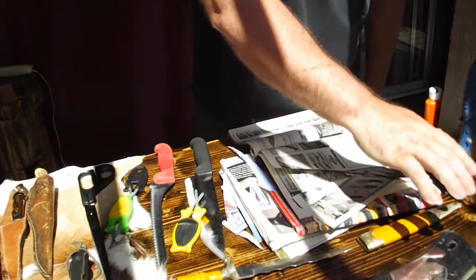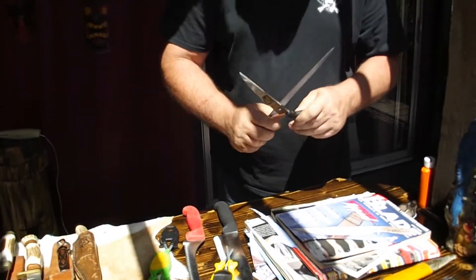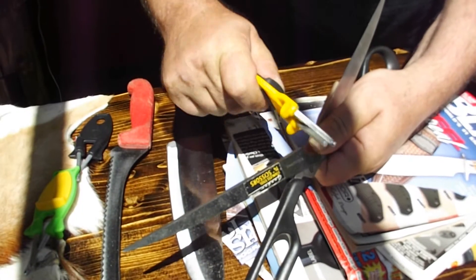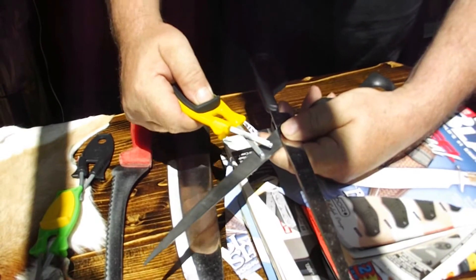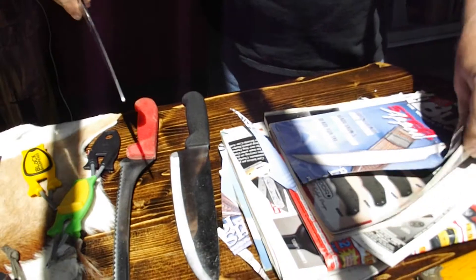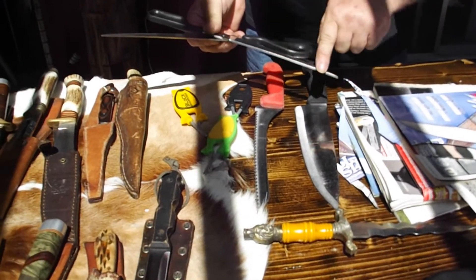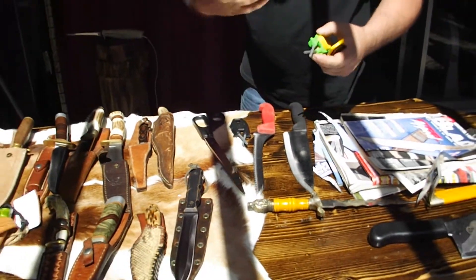I do cleavers in the kitchen, stainless steel, very hard steels to sharpen — sharpen them like that. Use the side of one rod, follow the bevel, that breaks it down. This is good to use on garden tools when they get rusty — follow that edge, it will clean it up. Turn them and you will get a burr in here — knock the burrs off. Your everyday kitchen counter scissors, anything like that. Garden tools — you see you get them very sharp. Just follow that edge, square to corner.